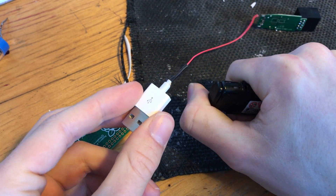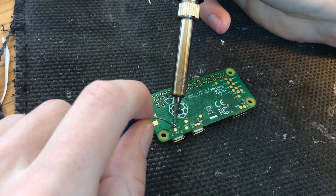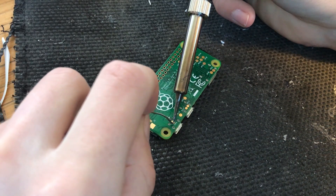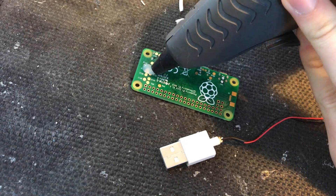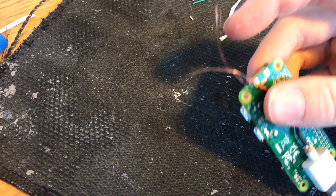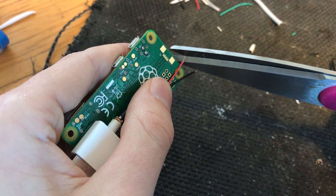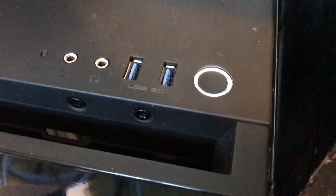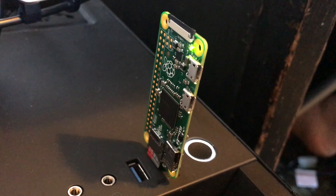I may have ever so slightly burnt the USB plug in the process. Then I tinned a few of the pads ready for soldering on the power connector — the top one is the 5V input and PP6 just below it is for ground. The solder ended up looking a bit dodgy but that was just because my soldering iron was on too low a setting, though I fixed that off camera. After that I went ahead and hot glued the power connector onto the Raspberry Pi itself and kept it seated in place while the glue dried. After stripping the red and black wires with my teeth, I cut them down and got them in place, used a bit of sticky tape to keep them in position, and soldered them onto the corresponding pads. At this point I thought it would be best to plug it in and see if it even powers up — I plugged it in and lo and behold the lights lit up, so I'm going to take that as a yes.